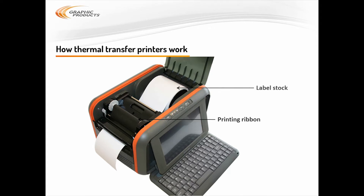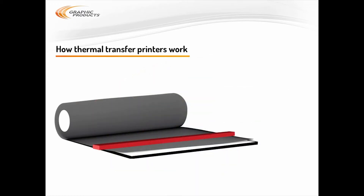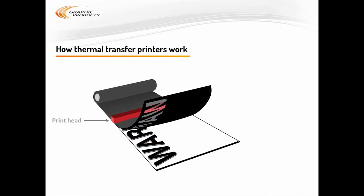That's the ink for the printing process. The paper is your label stock, usually made of vinyl with an adhesive backing. When you print a label, the resin side of the printing ribbon is pressed against the smooth side of your label stock, and together the two are passed underneath the printhead. That printhead includes a line of tiny heating elements. When those elements heat up, the colored resin gets transferred from the ribbon onto the label stock — thermal transfer. Turning those elements on and off as the supplies move past the printhead creates a pattern on your printed label.